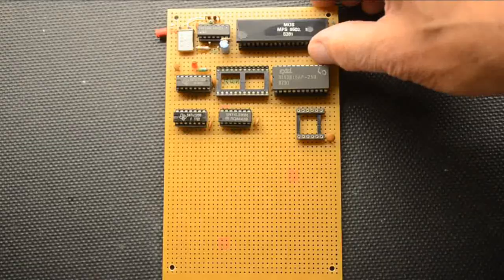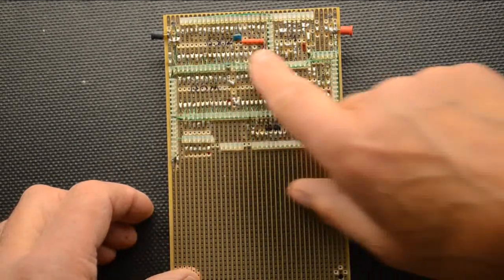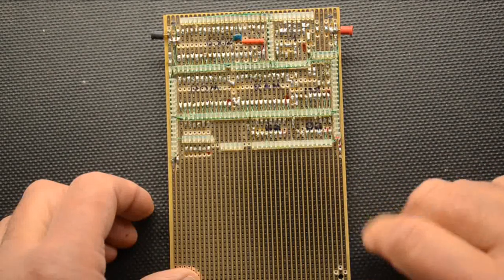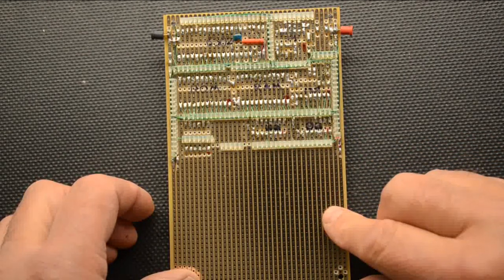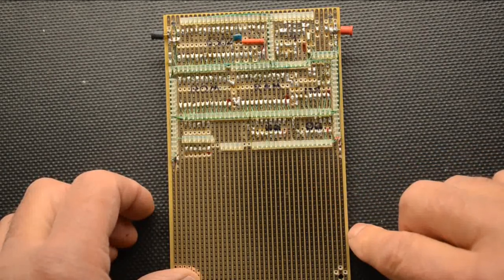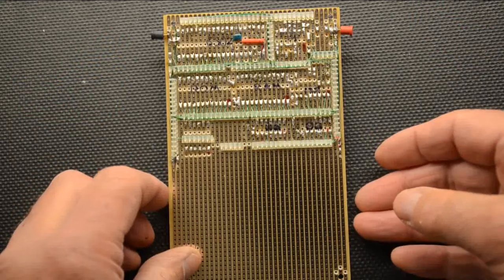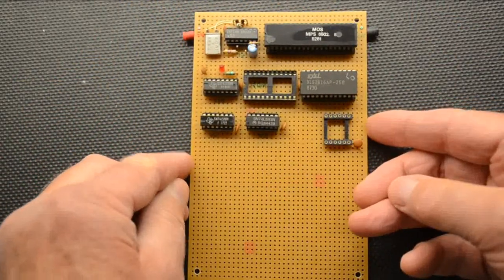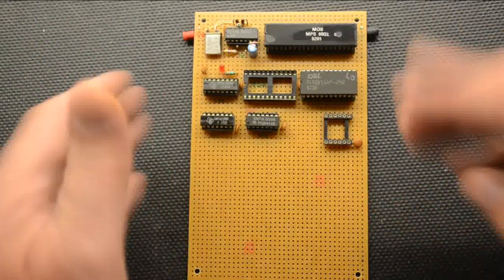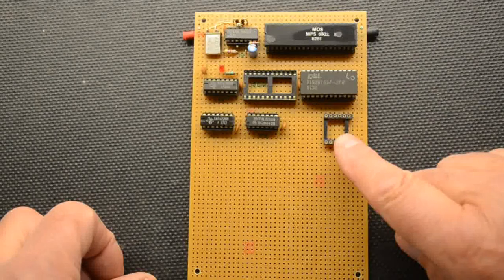This is the board as we can see — it's using the system with the wiring combs. If anybody was watching closely during the construction, you'd realize we actually swapped a couple of ICs around, because when I started wiring them up for the demonstration I was taking it to the wrong one. Fortunately I spotted that. These are now the other way around. There's no display because I made a socket for it, and there's no RAM either — we want to check the thing works with as few components as possible.